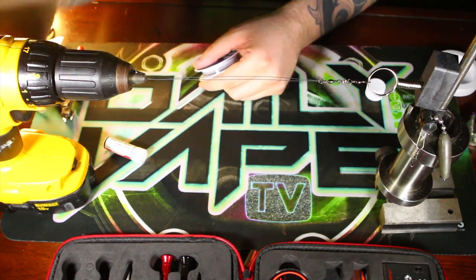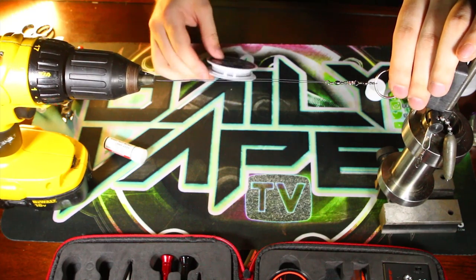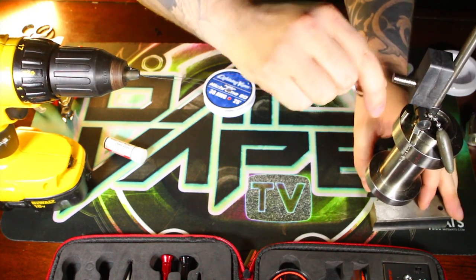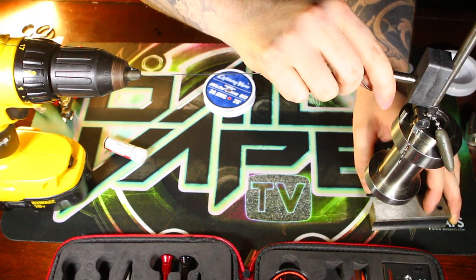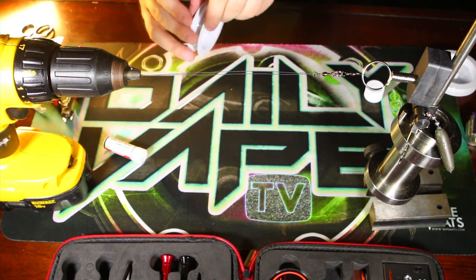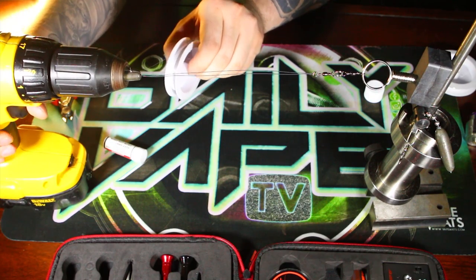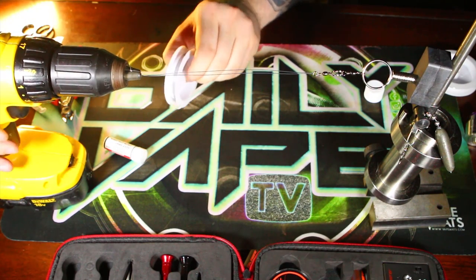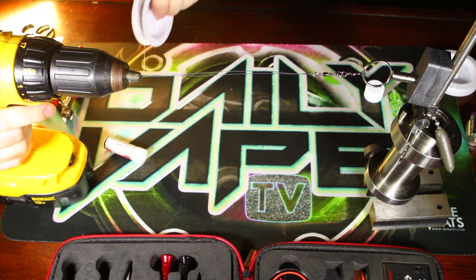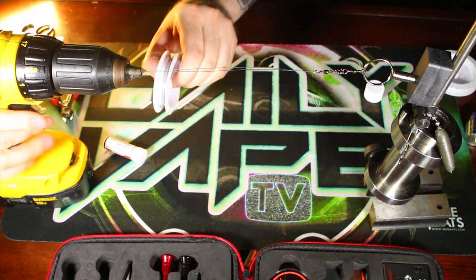You can put a little bit of tension on the wire but you don't want too much - that's the key. You can basically have the wire pretty much floating; you don't even have to have it actually connected to the magnet, just floating ever so slightly away from it, but it's going to want to attract pretty strongly. Let's just go ahead and get started, make sure the drill is turning the right way, and spin it up.